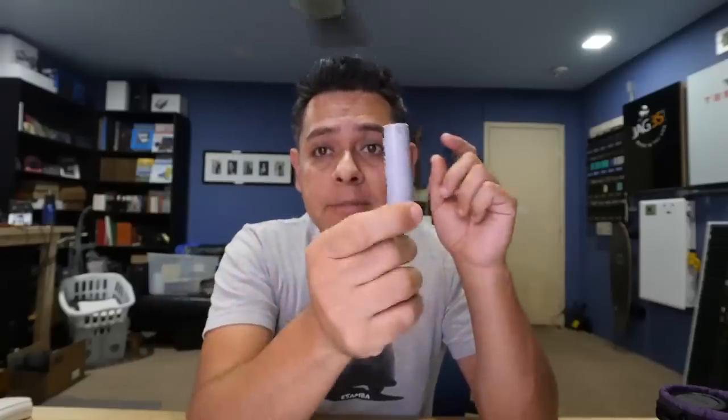These chargers are always kind of high. That's why it got me thinking that I need to test these to see how off they are, because they seem to test all the cells higher, I don't know how much, but they're all even with each other. I could put this cell in one charger and then in the other one, and it'll be around the same. So I know at least they're consistent with each other somewhat. And so then that would be your 1C. If this is a 3,400 milliamp hour cell, then 3.4 amps would be 1C, right? What I usually do is put it on my little charger here and graph it at 1C, at 3.4 amps. Then you see the discharge graph and what the capacity is. It's going to be lower than this one, because this capacity was at 500 milliamps, right?